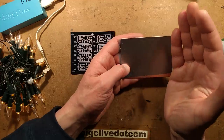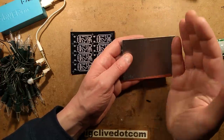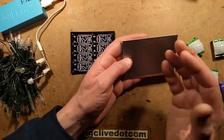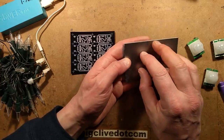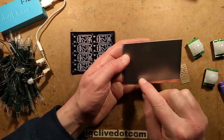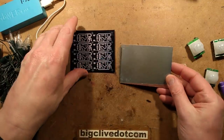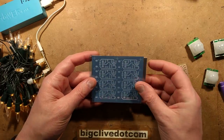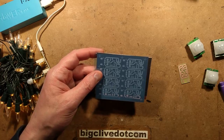Transferring this film is a very critical thing — if you don't heat it evenly over the whole surface it won't stick as well as it should. Likewise if you overheat it, there's not only the risk of steam but the plastic film on top can start shrinking with the heat and it shrivels up, causing all sorts of patterns. It's a bit unpredictable. What I'm going to do now is expose this with ultraviolet light and this transparency, then develop it, and then etch it.